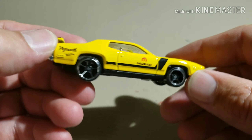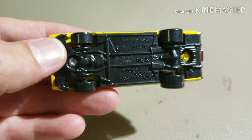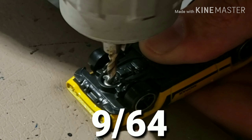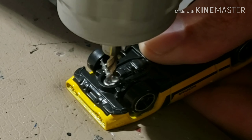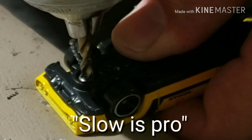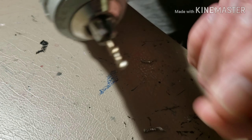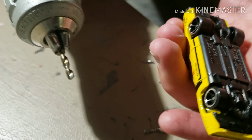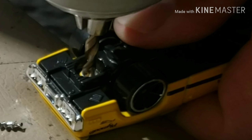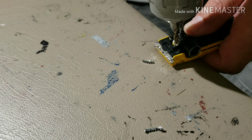To NASCAR this thing out should be a fun one. First things first, I need to drill out these posts. The first drill bit I'm using is a 9/64th, and I'm using a moderate amount of pressure. The name of the game is to go as slow as you can — the slower you go, the better results you have. It is not a race, and the goal is to remove that ring that holds it all together.